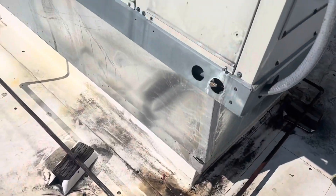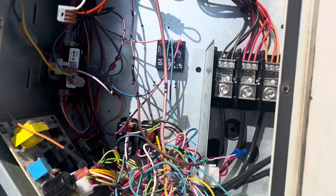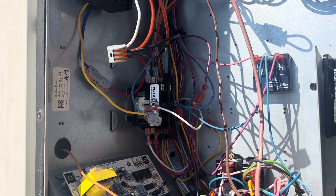So I was an hour away or so. I headed this way. My brain just kept thinking. I called him back and told him to pull the battery out of the thermostat. I've said it before — I hate batteries in thermostats. Because what's happening is he's not getting his 24 volts to the bottom. I had him confirm that. He pulled the battery out. Thermostat was dead.